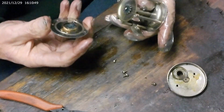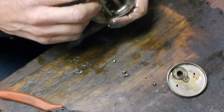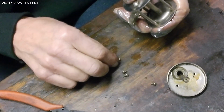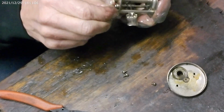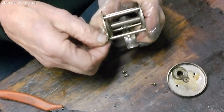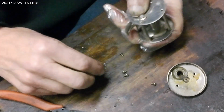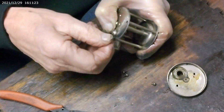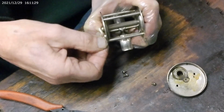All right, we've got to match up our side plate screws now. We've gone ahead and we've lubricated the inside of this from a spool standpoint, and we have one screw, as we noted, sits proud. It's too long for the pieces. That's okay. It's going to hold the side plate on nonetheless. And those of you that know me and watch the videos know me in small screws well. From time to time we have a little bit of a difficulty getting them started. So if you'll just bear with me.